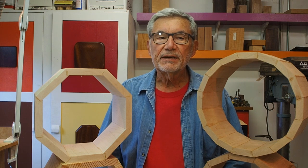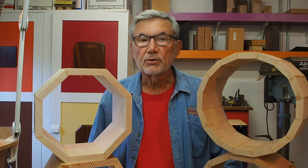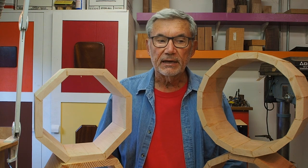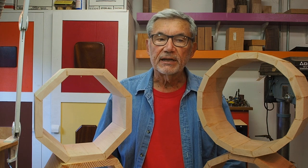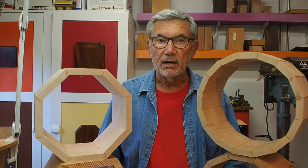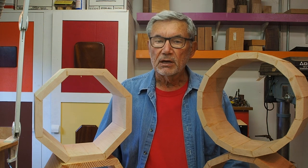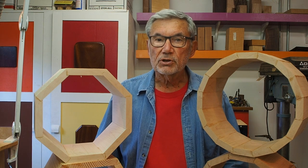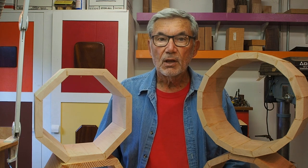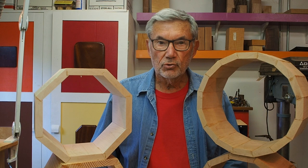Up until now, I've avoided giving any specific settings for height and depth, hoping to make the principles as clear as possible. However, in the following 3 charts, I have now provided specific settings that can be used as the starting point for cutting 6 and 12-sided BMJ joints, and in several common stock thicknesses. Dimensions are given in both inches and millimeters. Keep in mind that the settings are proportional to the stock thickness, and settings not given are easily calculated. Use of a Yonico bit is arbitrary. Many other bits could no doubt be used.